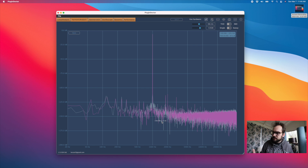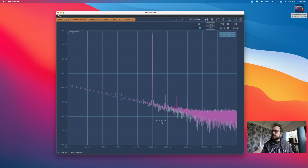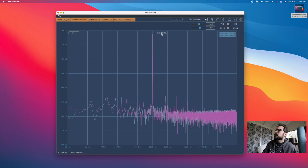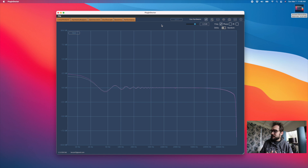Right now I think my favorite of the day is the Convert 2. If you're going out into the analog world and want things to sound a little more analog, Convert 2 can handle signal all the way up to digital zero and represent it fairly faithfully. If I was looking for just the cleanest possible analog in and out, I would stick with the Helo. And if I wanted it to sound like analog — if I was dealing with a digital file that's been digital the entire time and it sounds sterile — Convert 2.